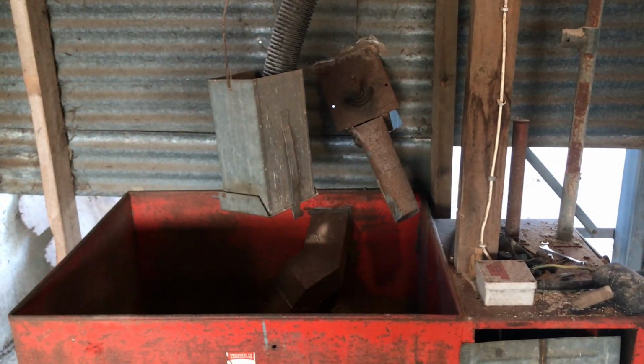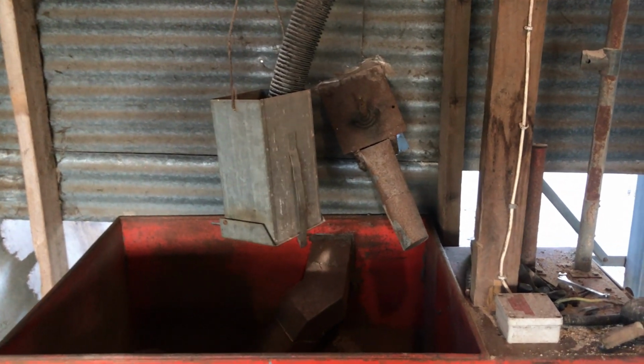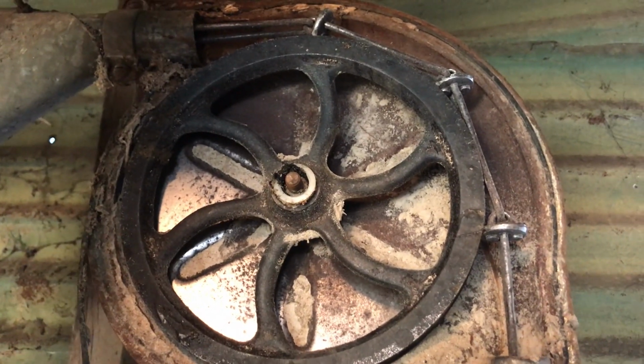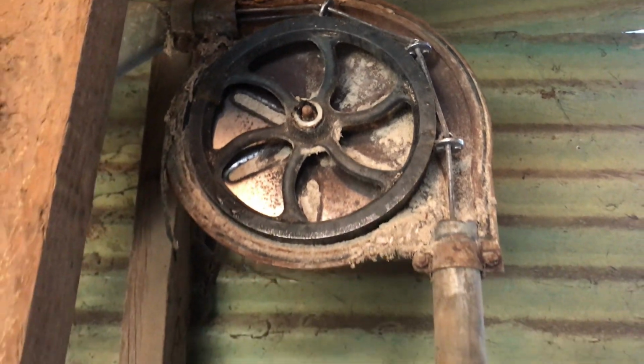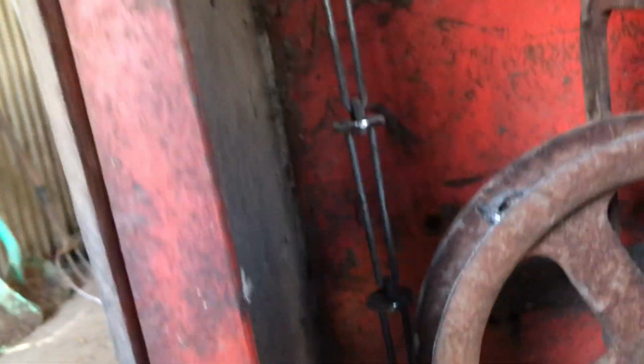Right, here's the automatic feeder for the pig pens, and this is the chain that goes around. I think it's called a pinion block chain or whatever. It's snapped, so I have to take this corner off and get in behind here, around here, and put another chain on. This chain snapped.